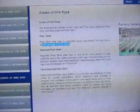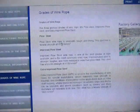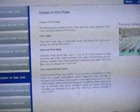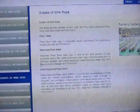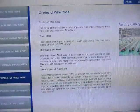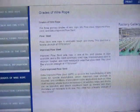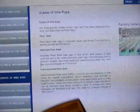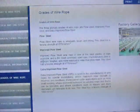Every square millimeter of cross section of wire can hold 1,570 newtons. That's approximately 157 kilograms — dividing quickly by 10 — and 157 kilos times 2.2 is about 345 pounds. So roughly 350 pounds for every square millimeter of wire rope cross-section. That's plow steel.